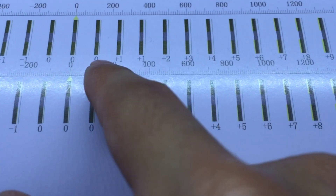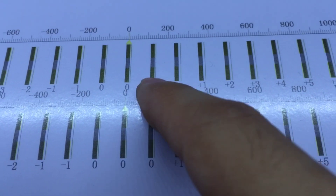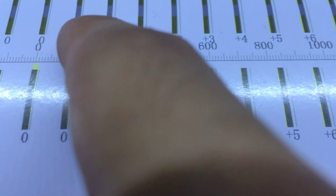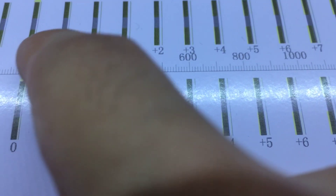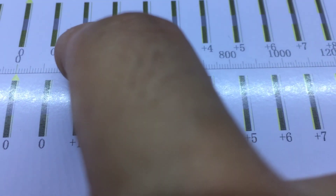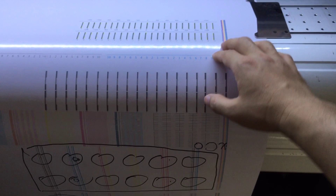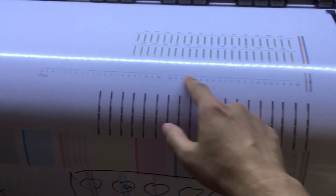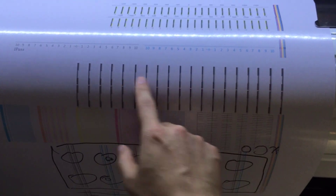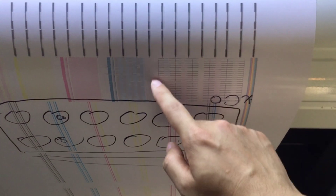The method is the same: find the best match at zero where the black lines print together. Looks like plus one is the best. So to summarize, these are the four calibrations: left-to-right and right-to-left, step calibration, both-direction calibration, and the print head vertical calibration and horizontal calibration.